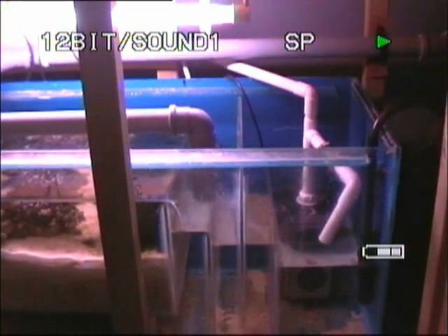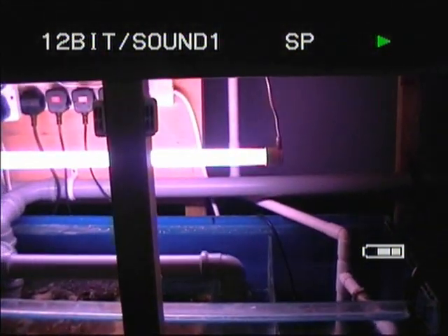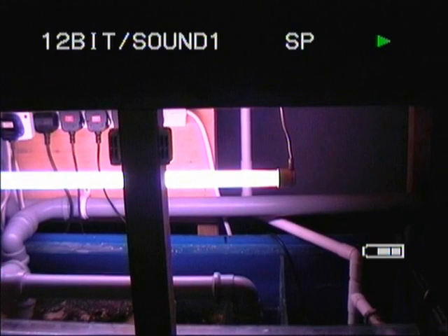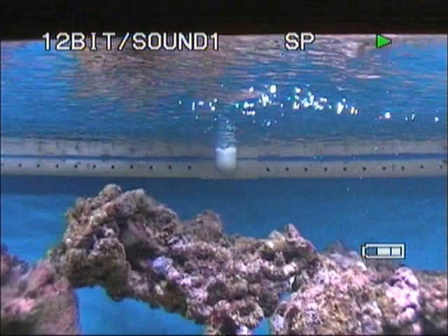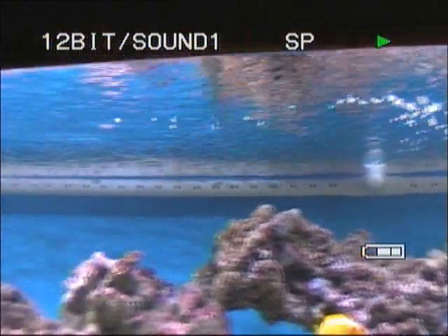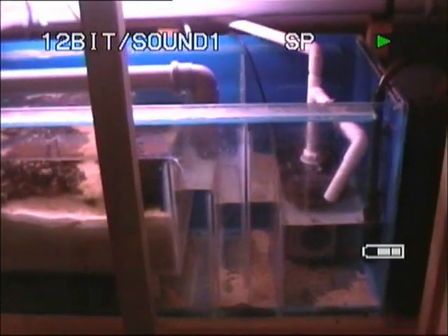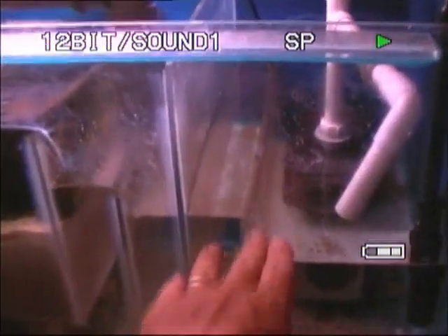It's that pump that, if the power is cut, obviously stops pumping up, and the water falls back down due to gravity. That's how you get this siphon effect — the main tank could actually pull water through those holes in the spray bar and back down into the sump and flood the sump. So you need to make sure there's enough room in this part of the sump to take this extra water from the pipes.